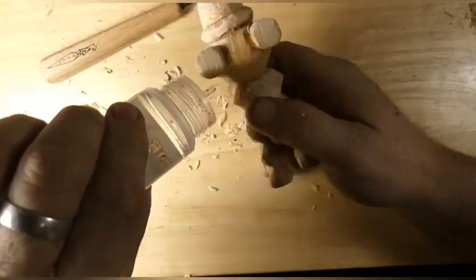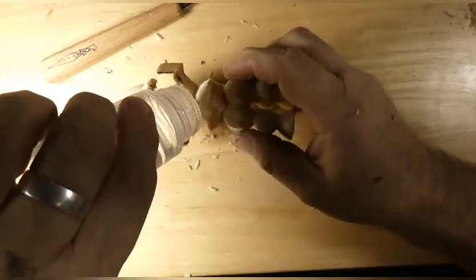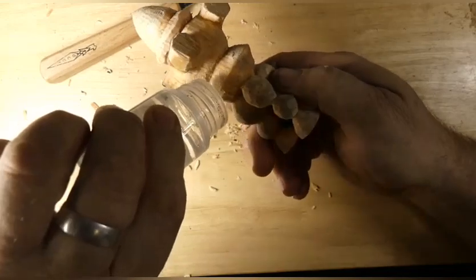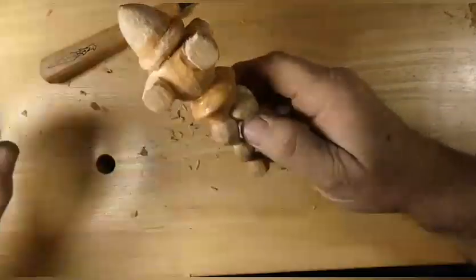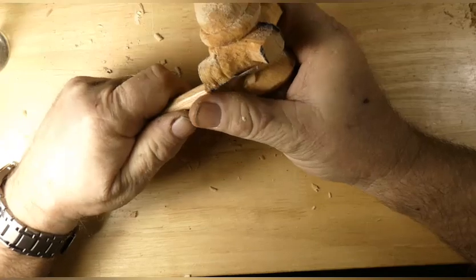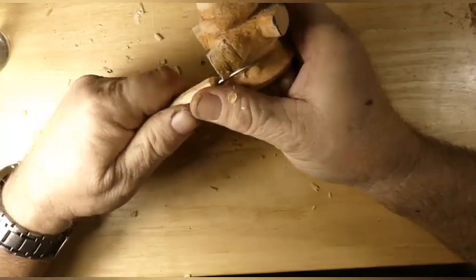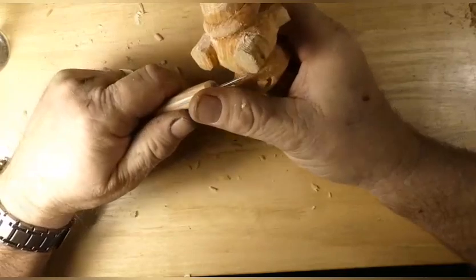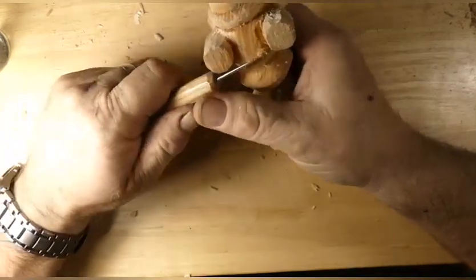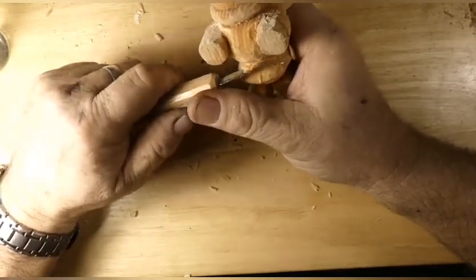And I've had that happen with basswood too, where you buy basswood from the same pack or the same lot, and we don't know if this wood was all part of the same lot. What happens is you run into a hard piece or a soft piece. So you're going to get variations in your wood even though it might be the same species. But if you get a lot of pulls in it, like I'm getting with this wood, when I make the cut, it will take a bigger chip than I want. It breaks out. You get a breakout.